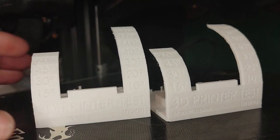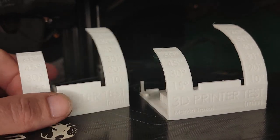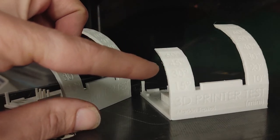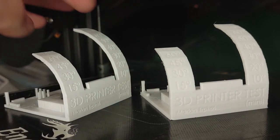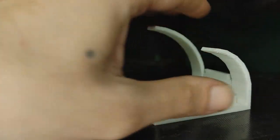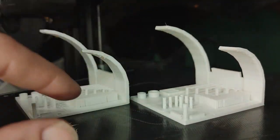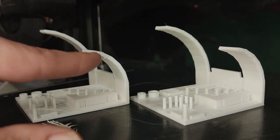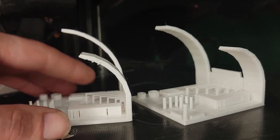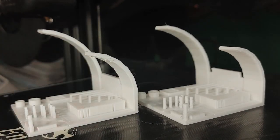While looking at these models we have a lot of things to compare — basically they are multi-print tests. You can see some stringing here, and that is a result of the retraction. The Artillery Genius is a direct drive machine, so I had retraction set — you don't necessarily need it set as high as you would with a Bowden machine like the Ender 3. It does look a little worse up in the top. Let's jump over to some pictures I took to get a closer look at these fine details.